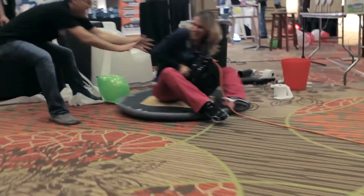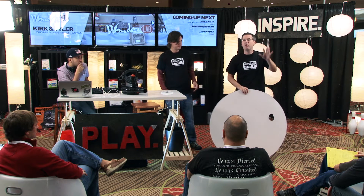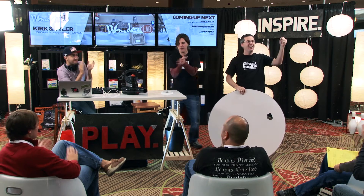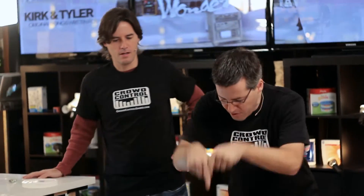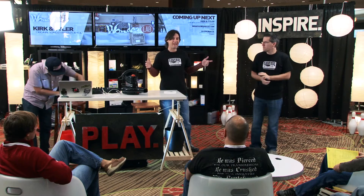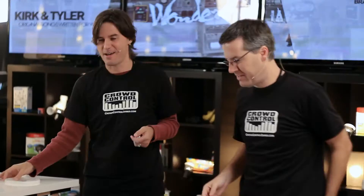It's really easy. You get a four-by-four sheet of plywood, cut it in a circle, and we're going to show you in less than about six minutes how to make your very own hoverboard. You lay it down on the ground, find the middle of your square by drawing a big X — where the two lines intersect is your center. Drill a hole in the middle, get a long piece of string, tie a marker onto it, and draw your big circle. For those taking notes: a four-by-four piece of half-inch plywood at Lowe's or Home Depot is about $11. Or get a four-by-eight for $15, cut it in half, and you've got two for just four dollars more.